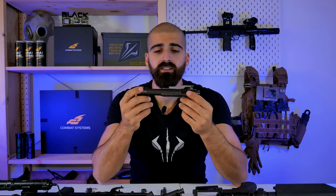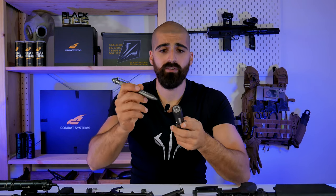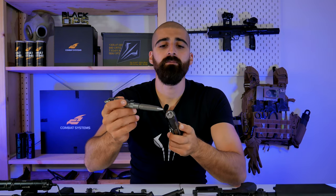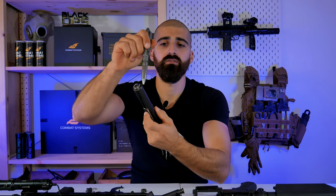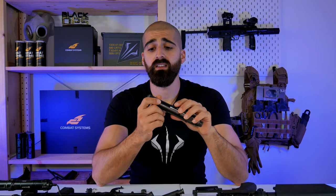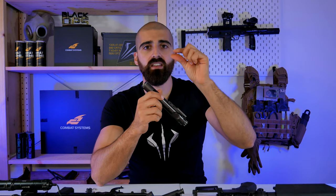The first issue was on the bolt. This is the bolt of the gun — this is where you have your spring, spring guide, nozzle, and right here on the back there is a part which holds in place your spring and spring guide. You have these two screws, and the amount of material between the ends of this part and the screws is very thin. With the action of the bolt traveling back and forward and the buffer hitting this, that material is going to get thinner and thinner.